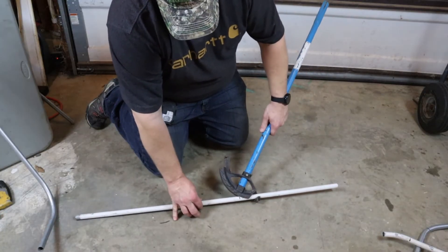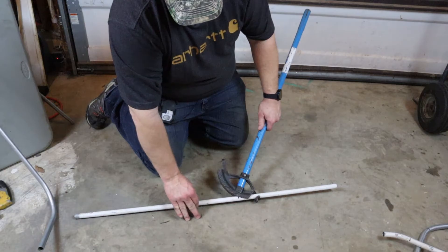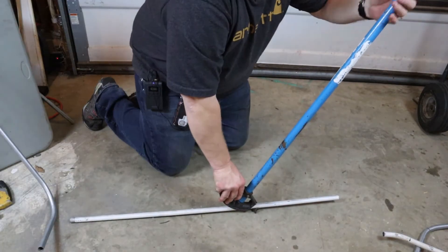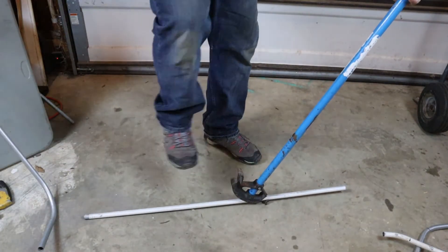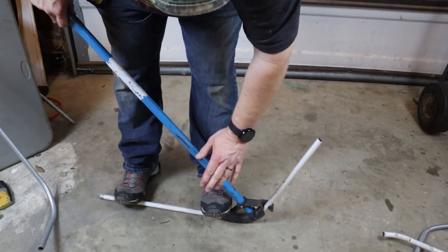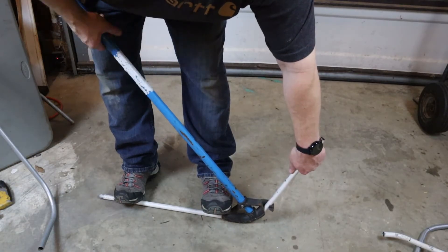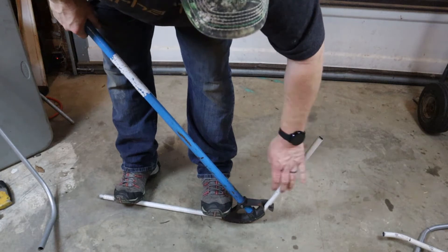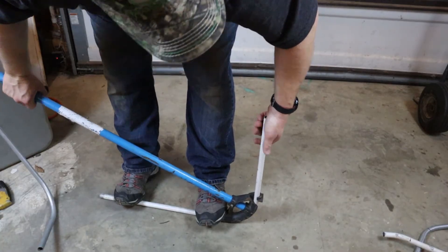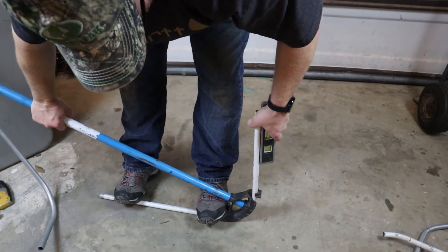So we're going to lay this down here. We know we've got to lay this hook that way, so we'll put it in the bender. What I do to make sure it's right is I'll angle my bender down a little bit and pull that mark right to the star, so the star keeps going straight on down, and then I'll just roll it up. Hold a little pressure down and pull her up. I always want to keep the most pressure right here — let your foot and the bender do all the work.